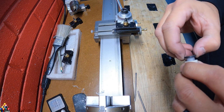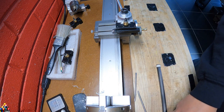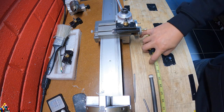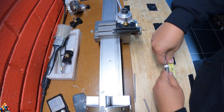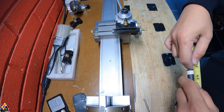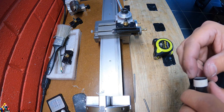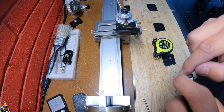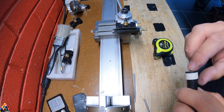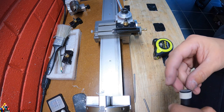As you can see, this is what I'm doing. So I got it to length, just like how the original was. You gotta remember, the white ferrule and this black G10 together are going to be the actual total length, not just the ferrule. That's just adding so much more weight, so we don't want to do that. We don't want to keep making this longer and longer. That just makes no sense. It just adds more weight, more deflection, and then the shaft hits like crap.